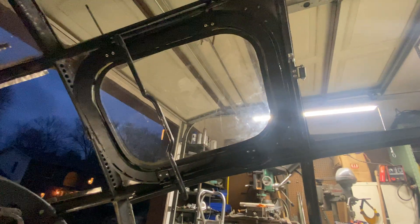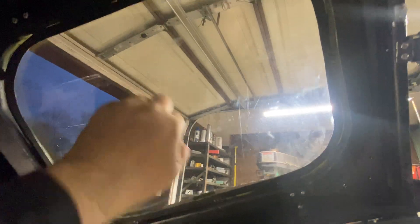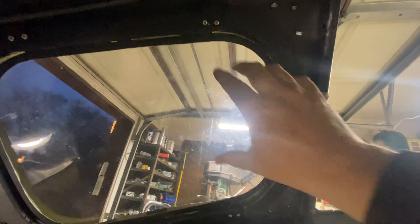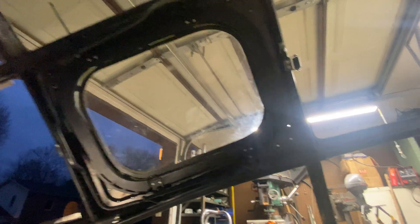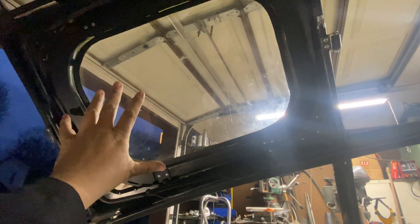What that does is not only make it heavier and give it a lot more strength, it locks up there like nothing. This gives me a mounting surface for about six screws here, some screws here and here, that allow me to mount the internal panel. That's very thin metal and it's going to go from here to here — kind of shaped fancy with some angles; it's definitely something they stamped. I'll probably have to weld that as well. I try to make stuff out of aluminum but I end up having to just weld steel. That piece that screws onto here has a gasket, and it's a little bit smaller, which holds the internal clear vision panel that you can take off and clean.